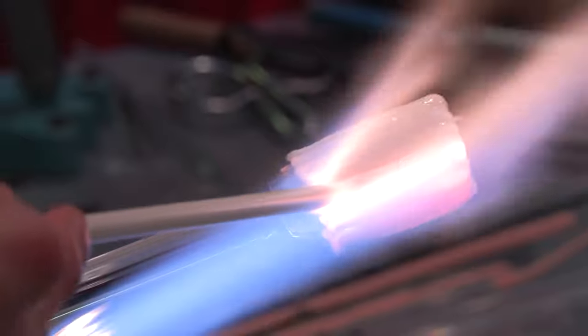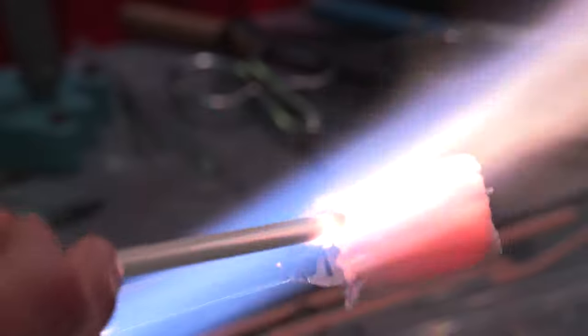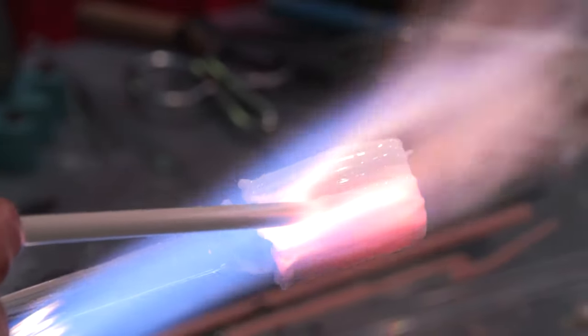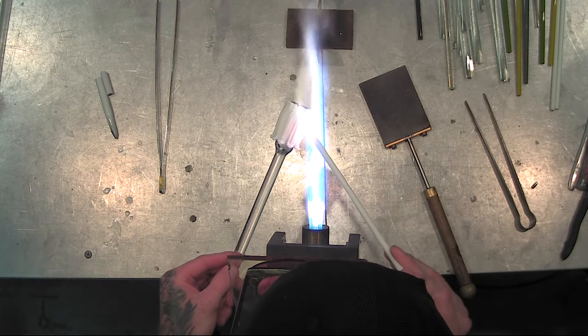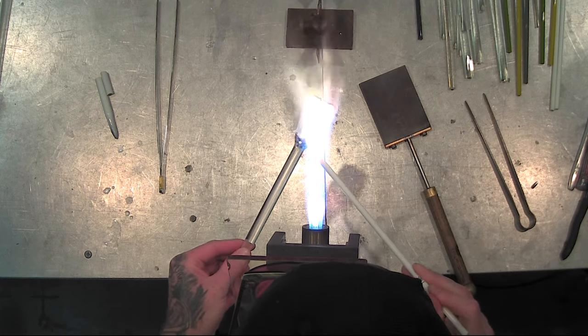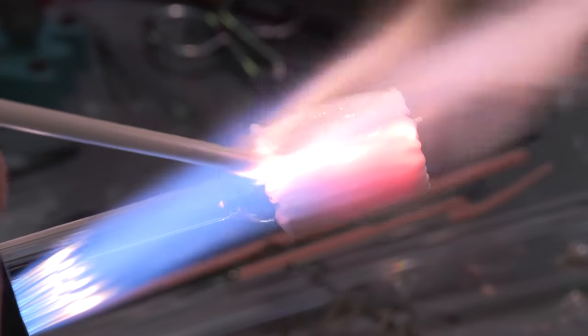And you can do that when you do an overlay. You're just going to have to let the tubing, or whatever you're applying the overlay to, cool down between each stripe. That's why I go opposite when I do an overlay for a color prep. I do one stripe, then go the opposite way, to let the tubing cool down where I just applied a stripe. Does that make any sense? Sweet. Yeah, it gives the material a chance to cool down between each stripe. And see, because I have those reference dots, now I know I'm coming back around to where I started.